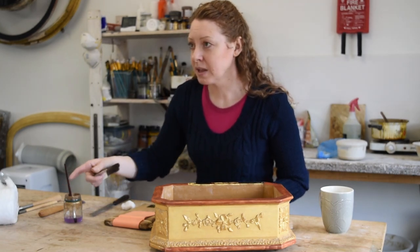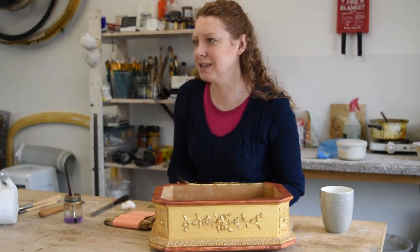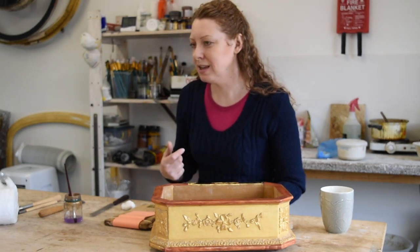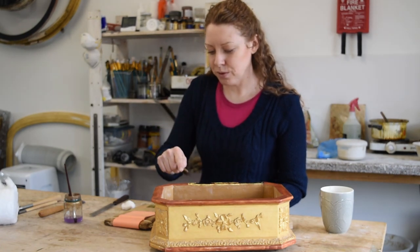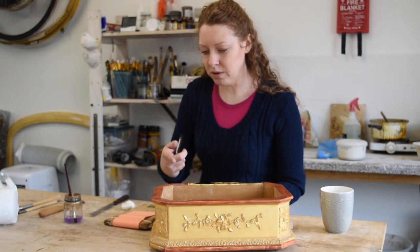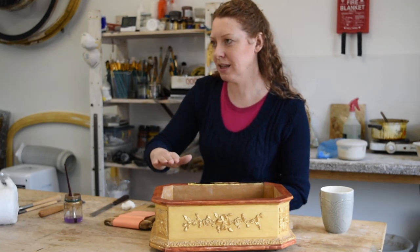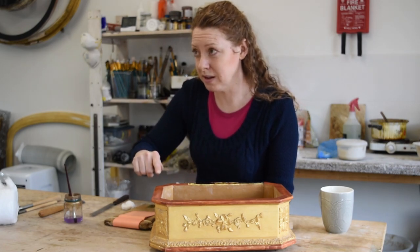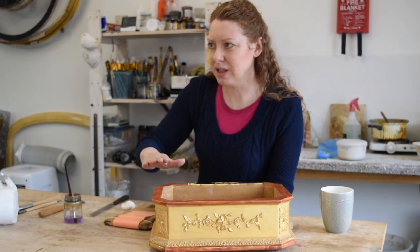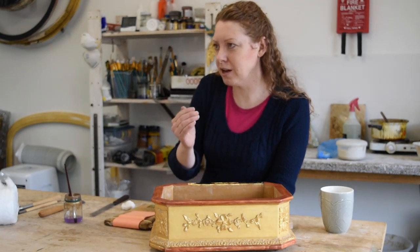So you still use those methods that were developed? The recipe I've got would have been used 150, 200 years ago — same recipe, same products. In fact, the one thing I can't do is put modern products with this. All these layers are all animal glue or rabbit skin glue based. And if you start to put a resin in there, it detaches — it doesn't like it. So if you're gessoing on top of car body filler, if somebody's repaired something with car body filler, in about a year's time it'll peel off.